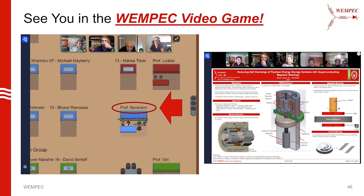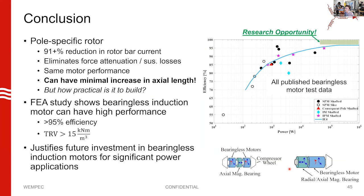Question: is there a reason the rotor bars were not skewed, and would it affect the suspension force? If you skew your rotor bars, you start to create an axial force component in addition to a purely radial force component — a new can of worms that needs to be solved. We were able to get acceptable torque ripple without any skew using the slot-pole combinations we picked. One trick to solving the axial force problem is to use the twin bearingless motor configuration with two bearingless motors sandwiching an axial bearing, skewing in opposite directions — the axial forces cancel out.